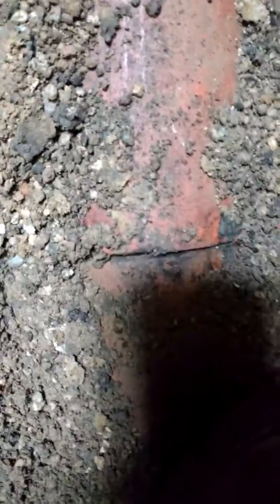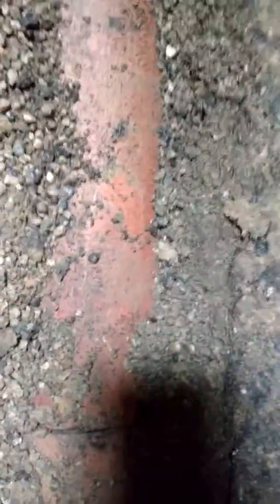The drain tiles have nothing to do with how and why water gets in through the wall through any kind of cracks like this one. This is cracked parging right here, if you can see it — it kind of thins out as it goes down, but it does keep going all the way down. You can see it bleeding. That's what we call it: bleeding water.